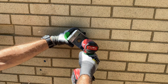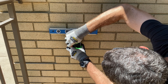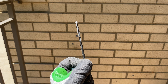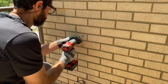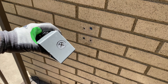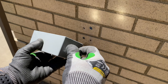I drilled holes into the new box — plenty wide — made sure it was level, and marked the location of those holes on the brick. I'm going to be using TAPCONs along with a carbide bit and a hammer drill. You can drill through brick with this; just make sure the bit remains cool by dipping it in water. Once that was done, I added a plug to the top of the box and also used a strain relief connector to keep everything nice and water-resistant.